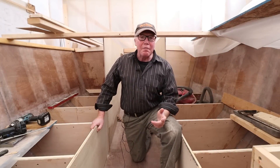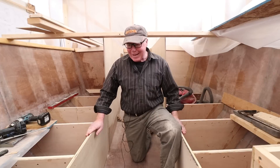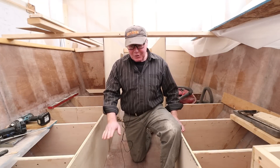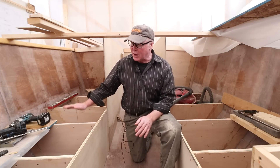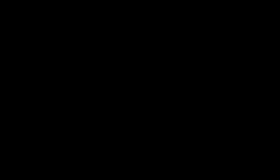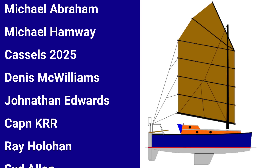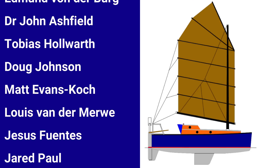Rovers, I felt as though we got a fair bit accomplished. It certainly looks like we produced a lot, because these big panels when they go in cover a lot of space. These are the last two longitudinal bulkheads, and they're not finished — I still have to do the fillets and the fiberglassing. But the next step will be fitting the top of the bunks, and it's not just the top of the bunks — there's a lot of structural components that will be built off of the top of the bunks once they're in. The Wave Rover patrons, with their pledges of support, really do make the creation of these videos possible. If you'd like to know more about Wave Rover's patron page and benefactors bulkhead, I have links to both those pages in the video description.